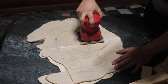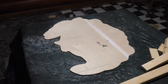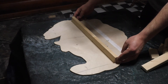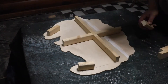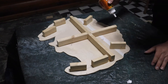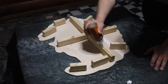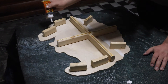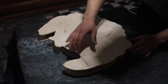You can see I've primed this face panel and used it as a work surface in the past, so we're just trying to make it completely flat because that's what our final product is going to be laid over. Now I'm taking my crossbars, starting in the center and working my way out, putting them in all the areas that really need structural support. This wood is a little flexible — we don't want it moving around underneath the fabric. I'm going to gorilla glue these in place; this stuff expands to like four times its size and then really shrinks when it dries, so everything adheres together for a very solid piece.